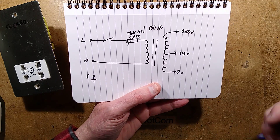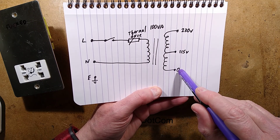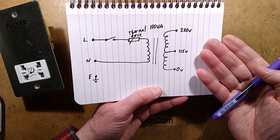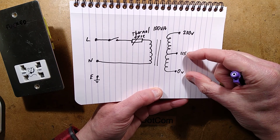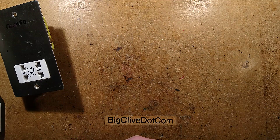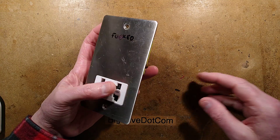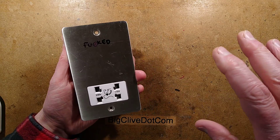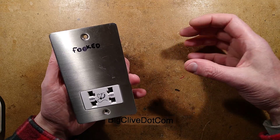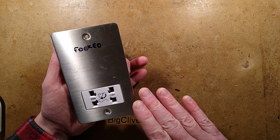On the outside it's got zero volts, which is now the effect of the new neutral, 115 volts and 230 volts. If you've got a 115 volt shaver, you plug it in there; if it's a 230 volt shaver, you plug it in there. The idea is that if you drop your shaver into the flooded sink and you stuff your hand in, you could probably get a shock across your hand, but you wouldn't get it through your body to ground.